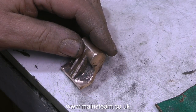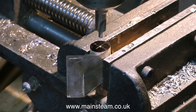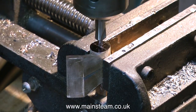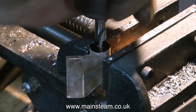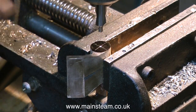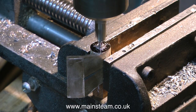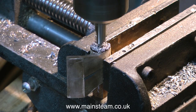It will look okay in the end. Even though this part I'm working on is actually two pieces, I'm working on it as though it's only one. So now it's time to drill the hole through the centre of it, and I'm making sure it's exactly where I need it to be. I mark it out and turn the drill chuck by hand just to make a little mark with the centre drill. And when that gets to be somewhere near, I put the power on and drill deeply into the work with the centre drill.